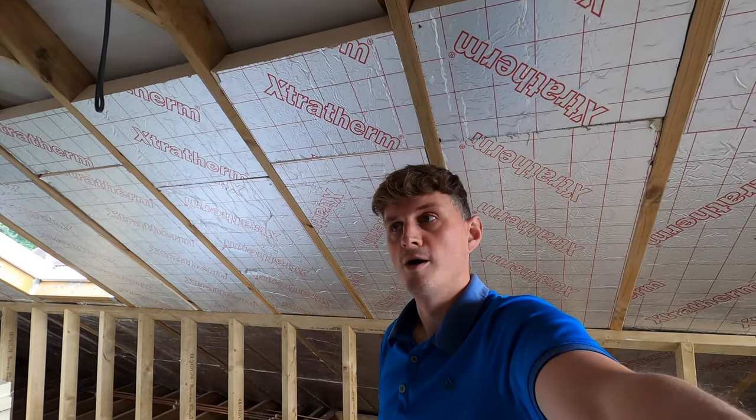So again, that's all the different layers. If you have any gaps, because these were nice and tight but have become looser and looser from just the plumber accessing it, me accessing it for my cables, so just make sure to put expanding foam or tape across any gaps, and that really helps seal all the gaps. And then you can see all this insulating I've done everywhere with the wall insulation, which is nasty stuff. Remember to wear a mask, but I've had to do that everywhere and all in the rafters over that side as well.